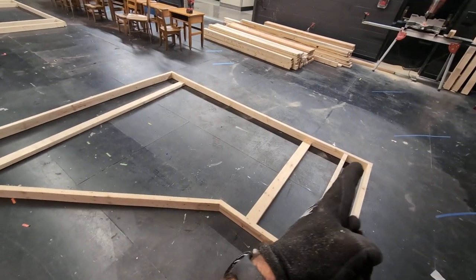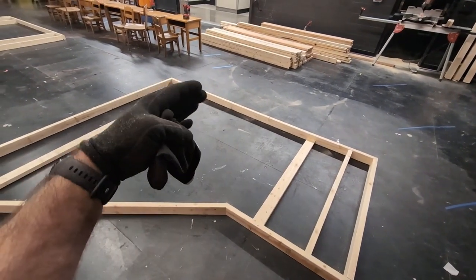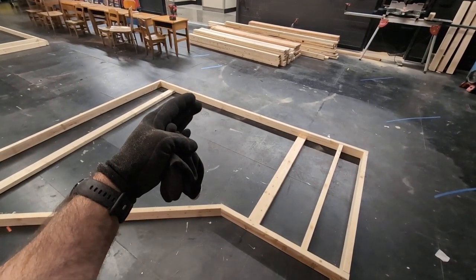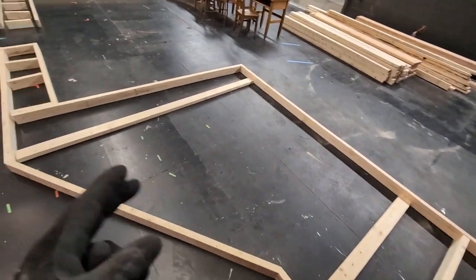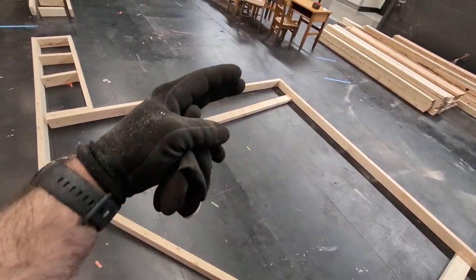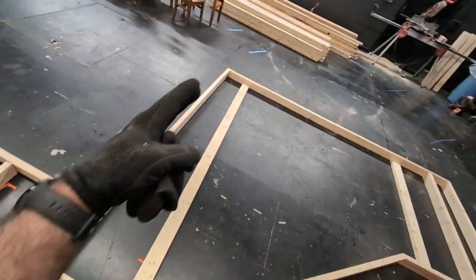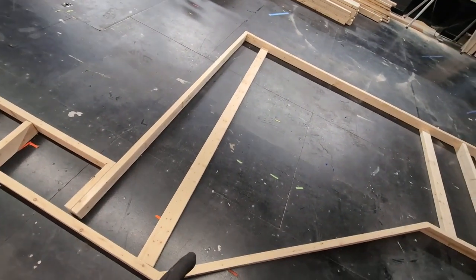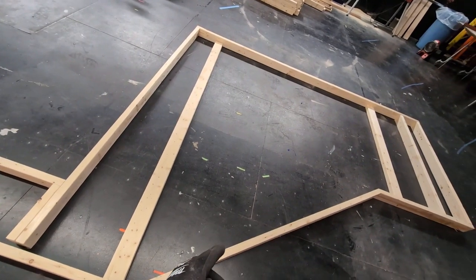And then I can start and put the layout on this lower plate and put everybody at 16 inches on center as per the drawing. And then all the bottoms of those will be attached correctly. And then we can start to rack this thing around and measure over from this long component if we're at 16 inches on center to that first one that has an angled side. And then we're 16 inches on center to the next one, and we find where he should land.